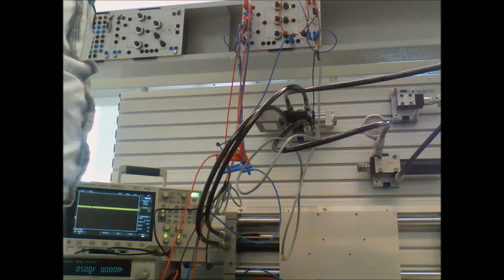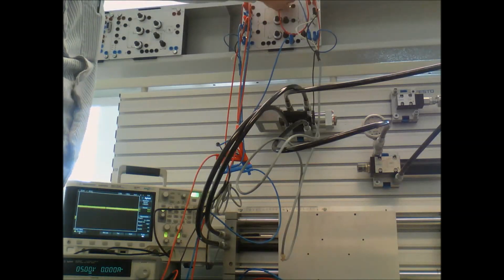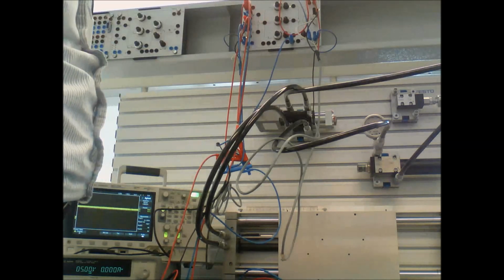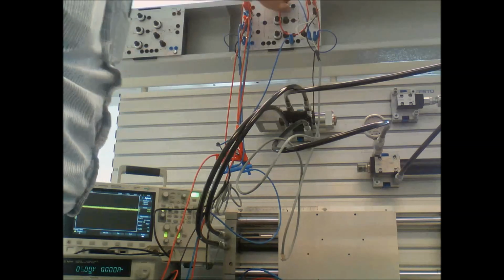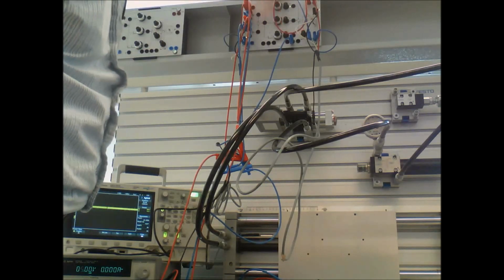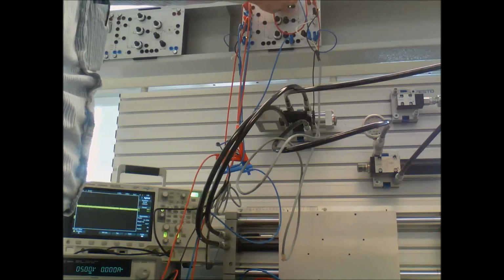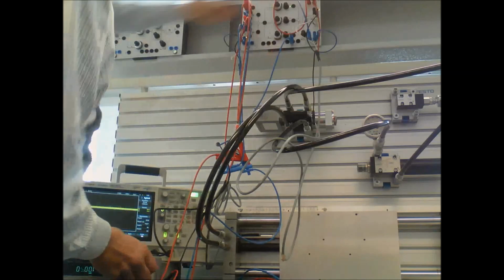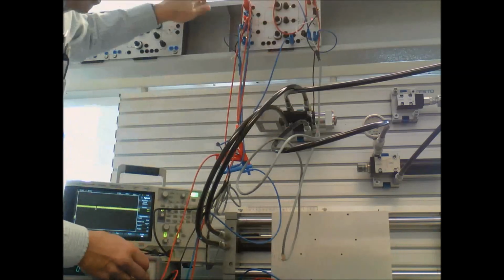So that's just playing with something, just seat of the pants. Turn off the integral completely. There's proportional control. I can turn it up. Now I've turned up by a factor of 10. If I turn up too high, the whole thing goes unstable. There I'm a factor of 10 from here, and let's see what happens when I change my set point.